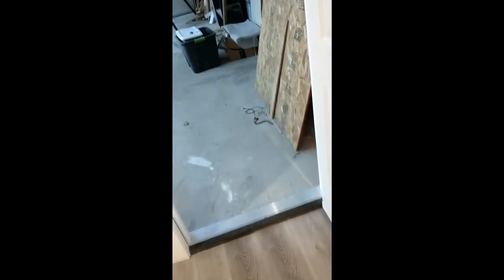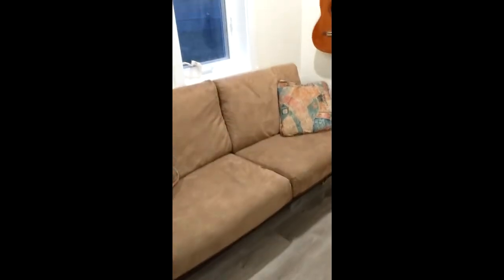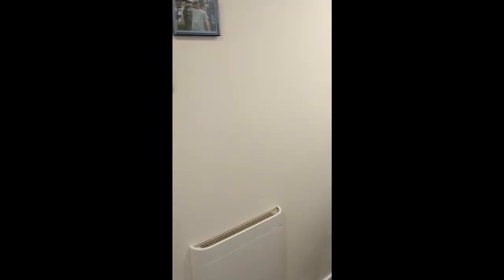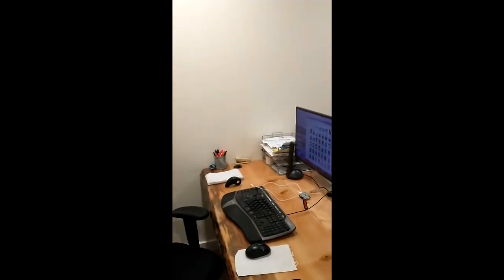I should have made videos on how to put the flooring down and how to do trim — I just didn't have time to do all that. Got my couch in there. There's my window. Got my pictures up, got these little heaters right now. Next project is to install a split unit right here and punch through the wall — that's going to be a bit of a challenge because the walls are so thick. I have two inches of foam, then an airspace, and then six inches of rock wool insulation. I did that for soundproofing in here. It's really pretty quiet — as soon as I close the door you won't hear those cars at all. I got this all set up and dialed in, just a little bit more to go.